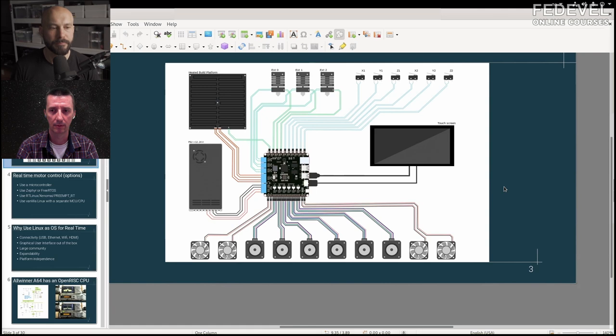There are four motors plus two extra. You also need to keep things cool — hot things hot and cold things cold. In this diagram there are three extruders, each with maybe a 40-watt heating element. The extruder is the head where the filament or plastic comes out — technically that's the hot end, but the extruder also includes the thing that pushes the filament.